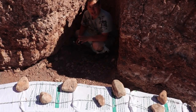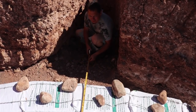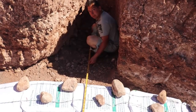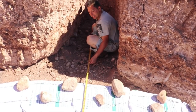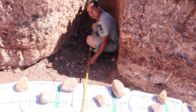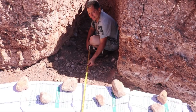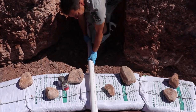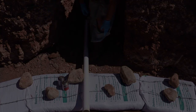Okay, so right now, I'm doing some preliminary measurements. And I just want to see where things are going to get laid out. So I'm going to be putting a pipe through here. I'm going to be placing a valve just slightly outside of the tank, mainly for emergency purposes, emergency shutoff. So what my thinking is here, I'm going to leave 6 inches going out into the tank, and that's probably going to get cut, but 6 inches for right now, and then coming 4 feet outside the tank.